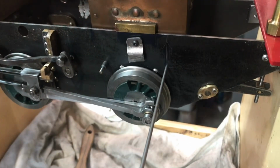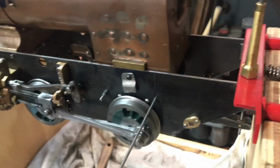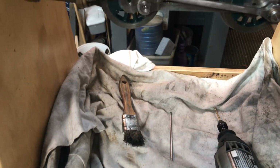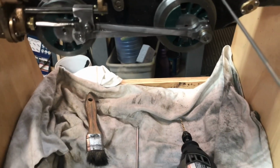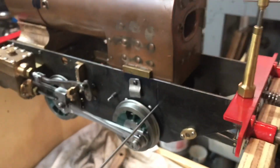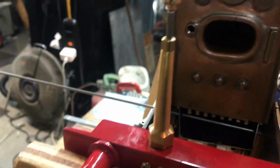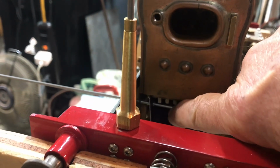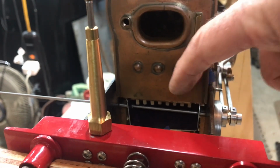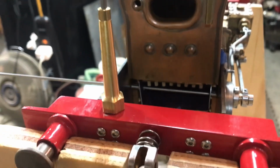Wouldn't hurt. Okay, success. This is something I was kind of dreading, making a little pin that goes across the back, but as you can see, I used my Dremel with a 3/32 inch drill. I used a center drill, after I marked it, I used the center punch. My goal here was to have the bar significantly enough below that it wouldn't interfere with the grate. I'm sure the grate will sag a little bit, and the bar might be a little bit too low, but I'm not going to worry about it.